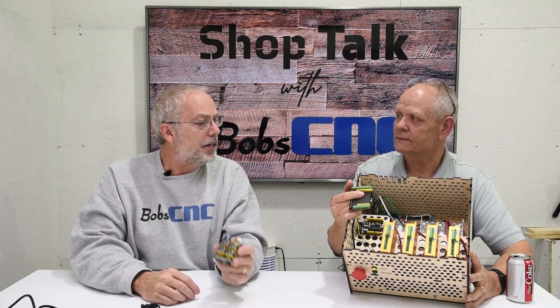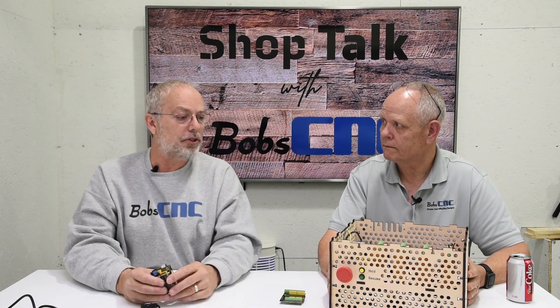On the other part of this machine, the E3 and the E4 don't have this. However, Brian from Wooden Creations has a little box with a resume and a hold button. We were kind of jealous, so we've included that on our KL7 — you get the resume and the hold. To one-up Brian, we actually added emergency stop too. Emergency stop is always good to have — it's going to stop all of the drivers.